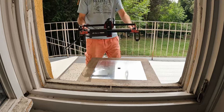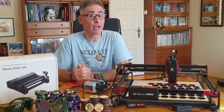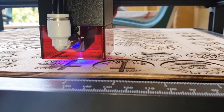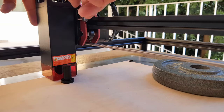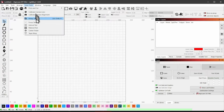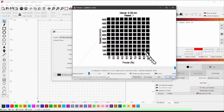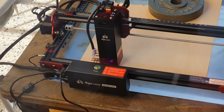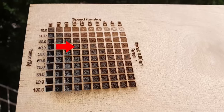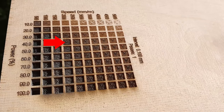While the foot risers were printing, I moved the DIY Mini to my porch. Many of these entry-level engravers come without enclosures or smoke extractors — we must always ensure our workspace is well ventilated to avoid inhaling fumes from burnt materials. Wood might smell nice, but it's bad for you. Next, we set the distance from the material using the focus assist puck and conducted an engraving test in Lightburn. I set the power to vary from 10% to 100% and the speed from 500 to 5000 mm per minute. I was pleasantly surprised how powerful this 10 watt laser is — at 500 mm per minute, even 80% power was sufficient to cut all the way through the 3.5 mm plywood in offset fill mode. Based on this test, I'll use 40% power and 2000 mm per minute speed for future engravings.